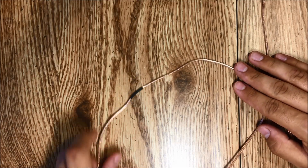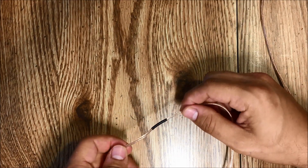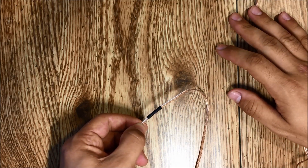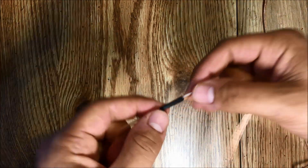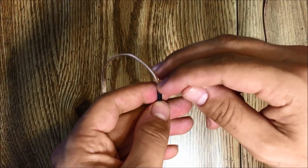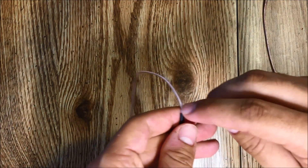Okay, so now I've measured it out — it's kind of hard to show it all. I didn't show myself actually measuring it, but believe me, it's measured out. I'm making this for 40 meters. A good rule of thumb for a 40-meter dipole is about 33 feet for each leg, about 66 feet overall. So I measured it out, marked it, and then slid some heat shrink right at the mark. The mark's right under the heat shrink — this is essentially the feed point. Right now it's all still together, but this will all be split apart down to here.